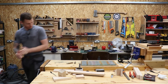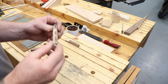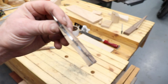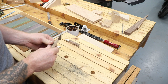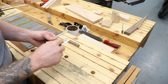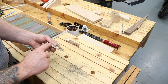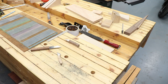I'm going to take a different approach here — I'm not too happy about how this epoxy is turning out. So I'm going to pull these handles back off and instead take a block of walnut, drill a hole in it, put the tang of the blade into that hole, and epoxy it in that way. That way we don't see any gaps front or back and I don't have to match the handle shape to the steel. I think that's going to look and work out better.